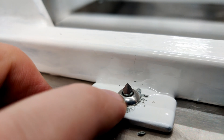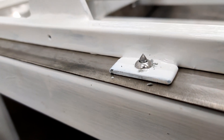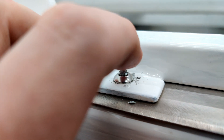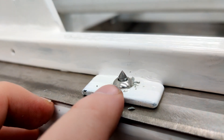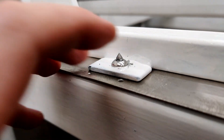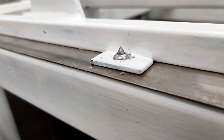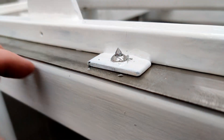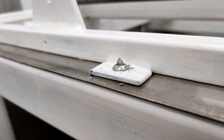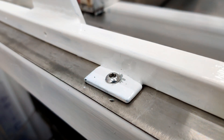When this bolt is put down into the steel tubing — the tubing is eighth inch, probably around two millimeters — that's not a lot of thread, and you need quite a bit of force to put a divot into stainless steel. If you use ones that are only threaded in slightly, you could lose it inside the tube and never get it back out. When the bolt is screwed all the way in, the hammering force is directed onto the bolt head and the surface, not directly onto the threads — otherwise you'd damage all the threads. After that, they just come out and you can use a regular allen key to remove them.